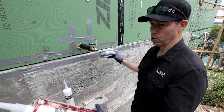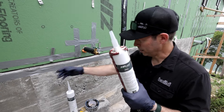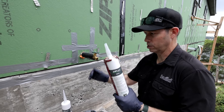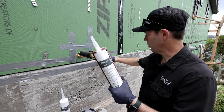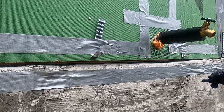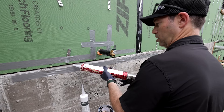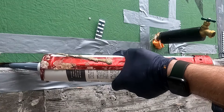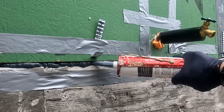We used some DuckPro from SureTape on this foundation because we wanted to stick to the concrete, and we're going to go about an inch down and tape that. The tape up here on the Zip sheathing is optional — I did that just to make a nice straight line, but you could just feather it out at the top and call it good. To use this product, it's pretty straightforward — just like a caulking. We're going to shove it as far into that joint as we can and caulk that first, to get a good bug seal.